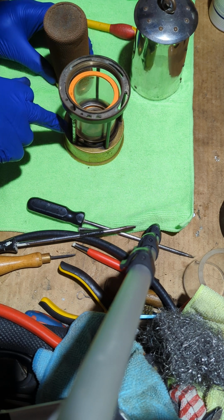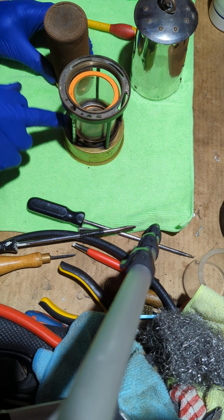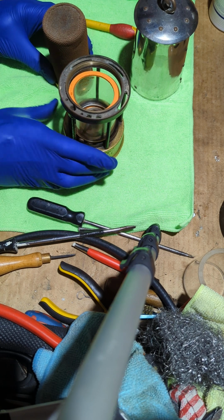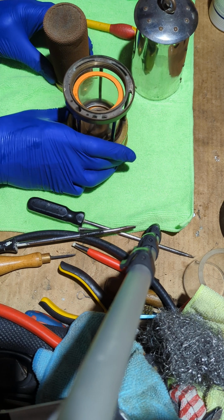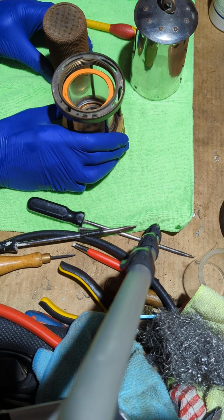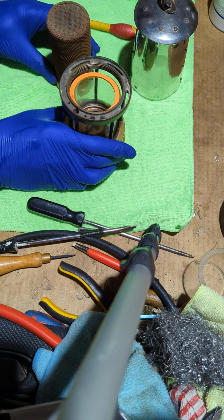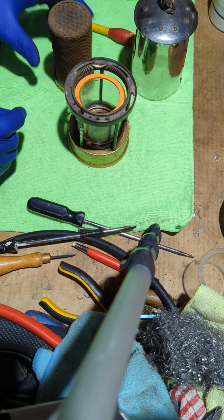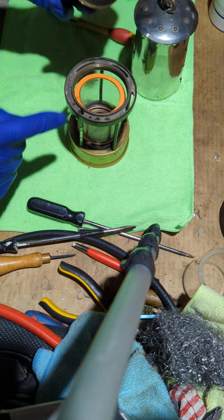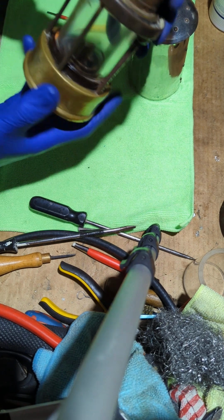This one, when I built it up, didn't have cotton wool in. Most of these lamps, normally we used to put cotton wool in the vessels to soak up fuel, so you didn't need excess liquid fuel hanging around. So if you wanted to carry it around or use it in that way, you're better off putting cotton wool into the base, just standard cotton wool bars you can buy from Boots, and then you can fill it up with paraffin or lamp oil, and then drain off the excess so you've not got fuel leaking out from the lamp. So we'd light it there and put it back together, and that's an MC40.